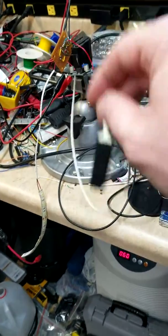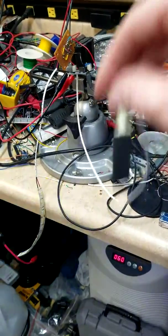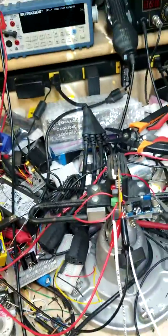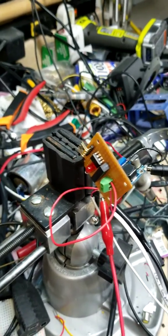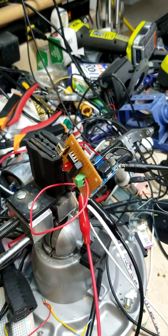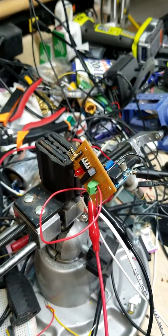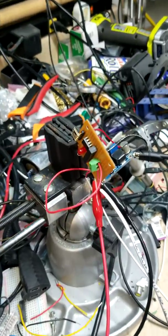So if you're going down a bumpy road, you're not going to be powering that LED on. If you hit a really bumpy road you will get occasional lighting of that, but hopefully I'm not going to be on those kind of roads. The other thing this circuit provides is a delay — or I should say an auto-off feature — so that if I leave the lid of the Goldwing open for 10 minutes, this circuit will eventually shut itself off after that 10 minutes has passed. Then the processor will go to sleep, and it'll keep me from running the battery totally dead.